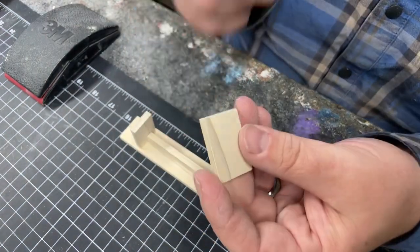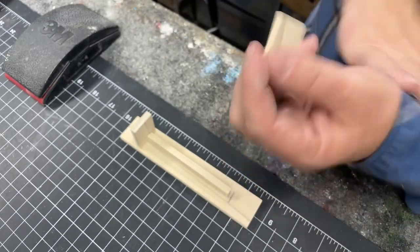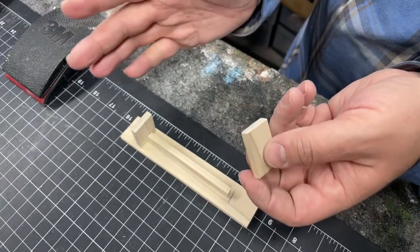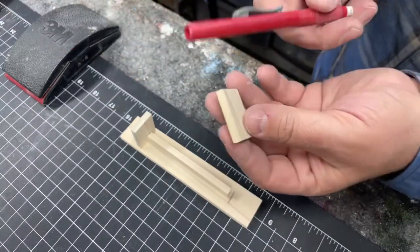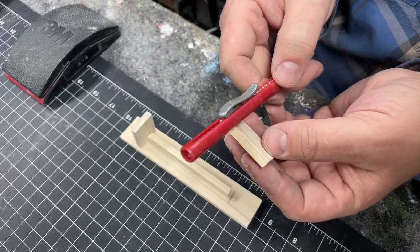At the beginning of the stream, I mentioned that this is kind of what I was naturally doing, but I was watching a master woodworker explain that this is a good practice, even with real full-size furniture, to just round over that edge, even if you can't even tell it was. Because what can happen is over time, you can have tools or pieces of fabric or clothing rub up against those edges.